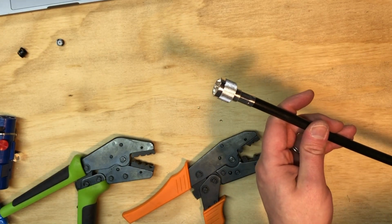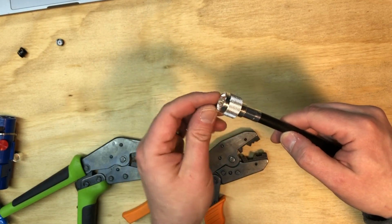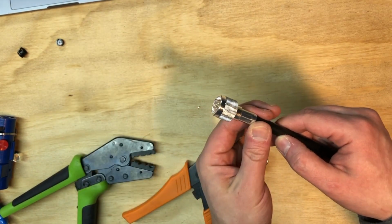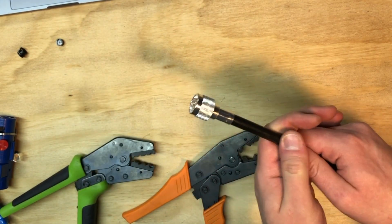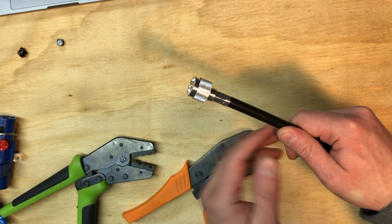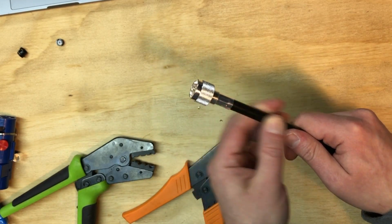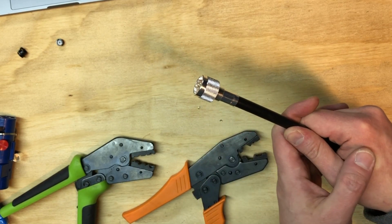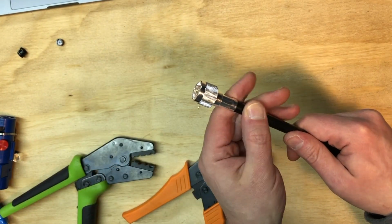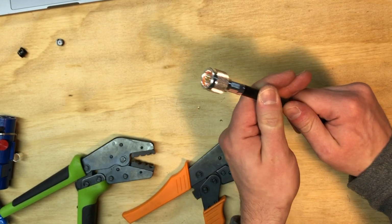The next thing we're going to do afterwards for our exterior connectors is, once we have these all screwed on in place, we're going to put that mastic tape all around it nice and tightly. And if we can get our hands on it in country, we'll use Scotchkote. It's like a rubber cement stuff, and we pour or paint that on top of the mastic tape, and it will last. That will be waterproof for centuries. So we're going to cover all this and the connector, and work our way up. But there you go, and that's how you put on an N connector onto LMR400 cable.